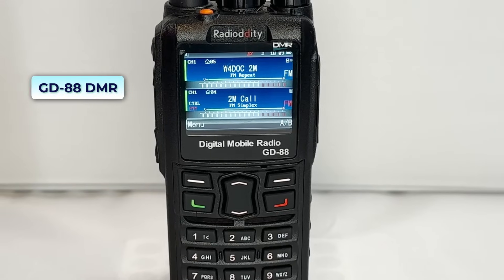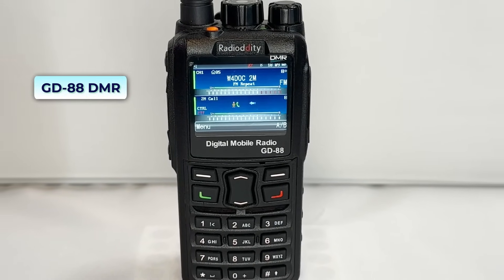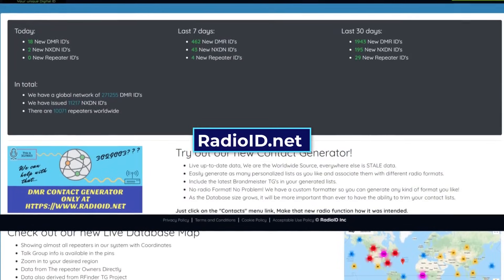For an honorable mention, we've been testing the Radioddity GD-88 DMR radio for a few weeks, and it's worked well on both FM and DMR repeaters. It has a bigger screen than the AnyTone. Radioddity's bundle includes a speaker mic, programming cable, and spare battery for just under $290. A couple of things to remember if you're going the DMR route: it is the most difficult digital mode to program. Your programming file is called a code plug, and you'll have lots of settings to adjust — one of those settings is called color codes, which are really just numbers. If you buy a DMR radio, expect a big learning curve. Don't forget to register your call sign too — to use DMR, you have to get a radio ID number at radioid.net.